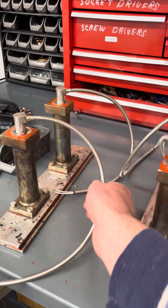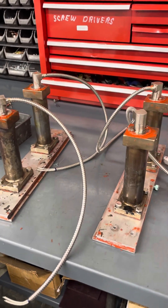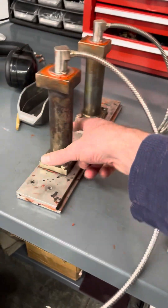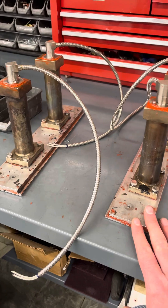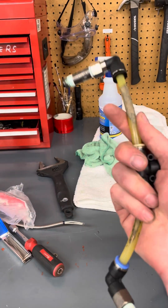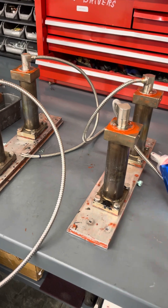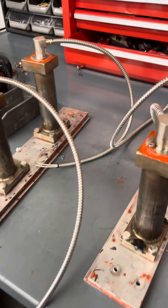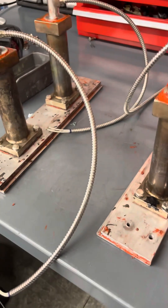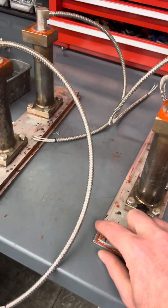When you are putting these together, keep in mind where your connection is. On the Hamer 540, it's right over here. I'd probably flip these around in an actual setting — put my thermostat here and my plug over here. When you do rebuild these, connect this — like this is similar to what's on the machine. Air hose to a little compressor. Do not over-compress; don't do like 100 psi. The machine runs up to 25 psi; you want to run between 7 and 15 psi on the actual machine. You don't need a lot of air. All you're really doing is getting some leak check. You plug that in and you're trying to see if you've got air leaks here, along the sides, the plug, right here.